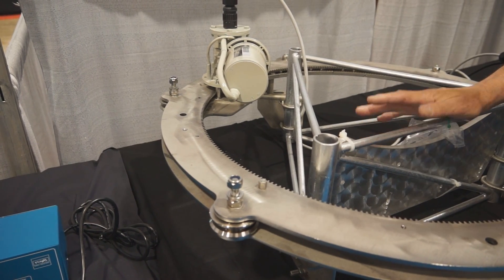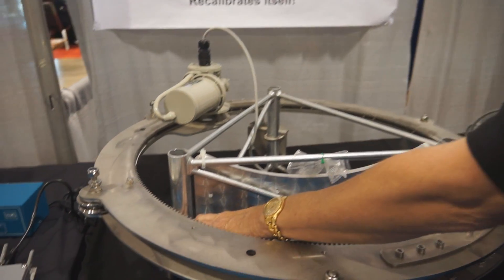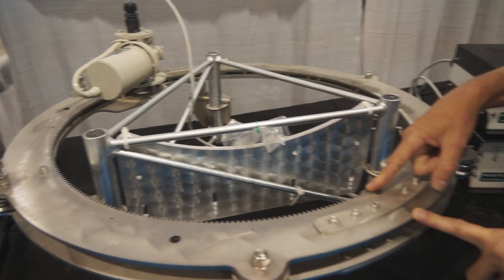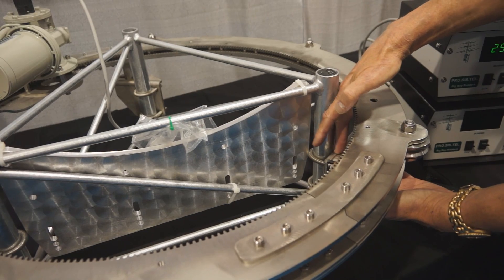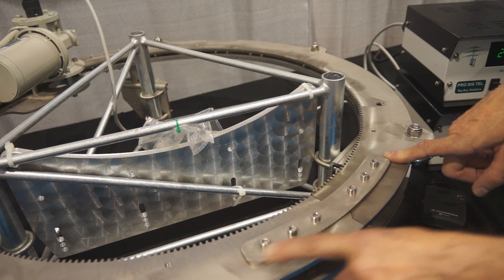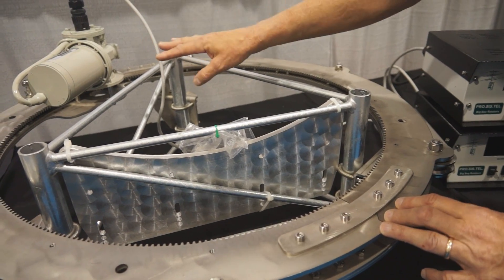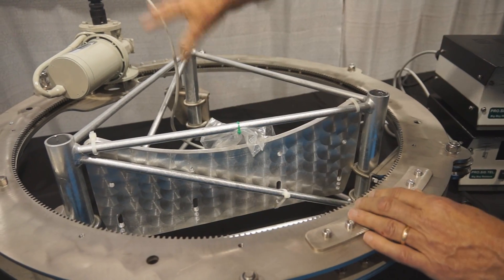To set this rotator up is a piece of cake — you can mount it onto the tower very simply by mounting the plates on the tower legs first, taking a level and leveling them, then bringing up the rings, which are split, one half at a time. Set the rings onto the plates, bring up the second ring, set it to its mounting plate, and bolt the splices together on both sides of the rotator. The last thing you do is bring up the motor and bolt it into place. There is no adjustment on the motor since this is precision made — no slop, so the gears are always engaged. It will not jump track like other rotators.